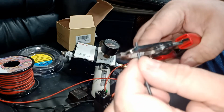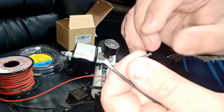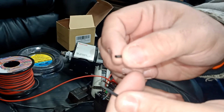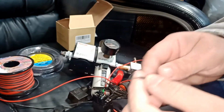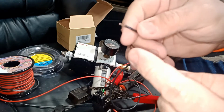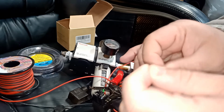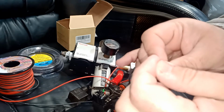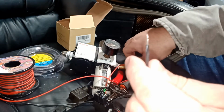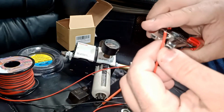Okay, so always make sure you're trying to strip it with the right tool or with the right side. When you strip it, you should not see anything cut off from this wire in here. The difference is that your wire becomes weaker, plus your amperage and voltage are not going to travel as it should be rated. So again, you're reducing the gauge of this guy, and the wire might get hot because you didn't do it the right way.